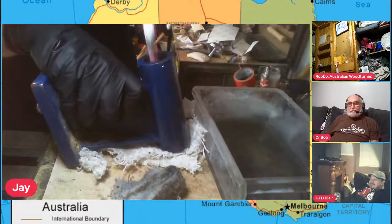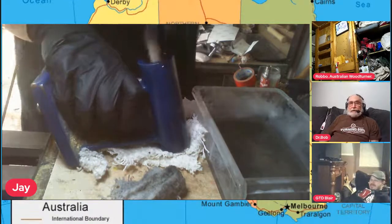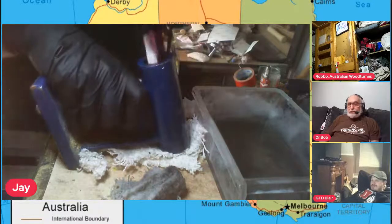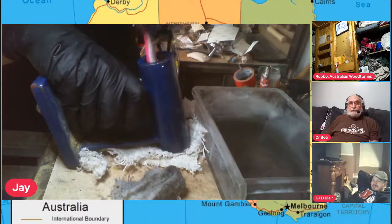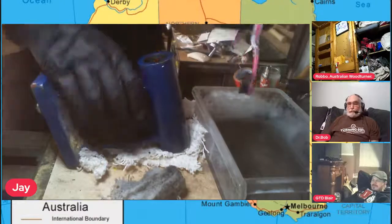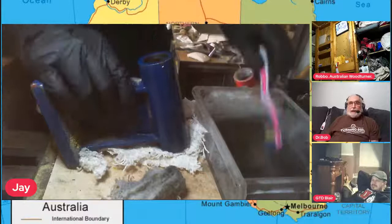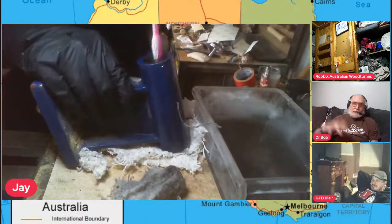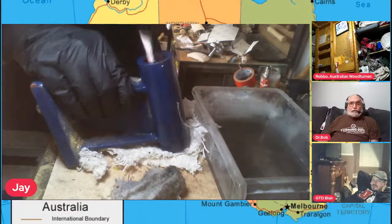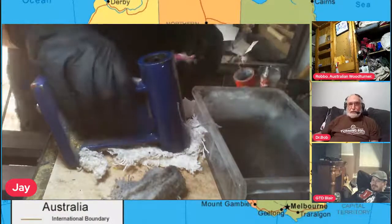Well, I've done that. A better hint for you: find a piece of wood and cut it down so it fits between the bedways with about a 1/16 of an inch to spare. Screw it to the piece of wood you're now using as a work table. But screw it to the bottom side if one side is better than the other. Okay. That way you just sit it in the bedways and it stays there, and it fits fairly tight.